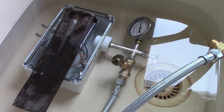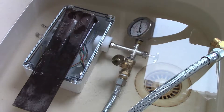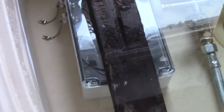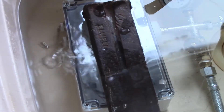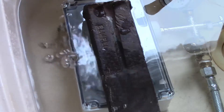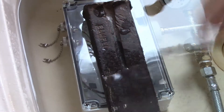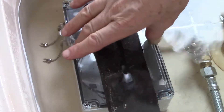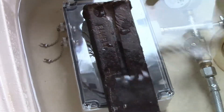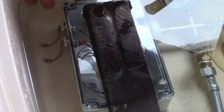Now I'm going to give it a modest... Would you bloody well believe that? What a bloody useless box - look at that. This is at such a small pressure that I can't even measure it on here. And that's just coming out between the seal to the top of the box in the middle. Rather as I thought, because I looked at this and I thought maybe there should be screws here as well, because we're just assuming that this ABS plastic or whatever is completely rigid. Because the force generated by a rubber seal is actually quite large.